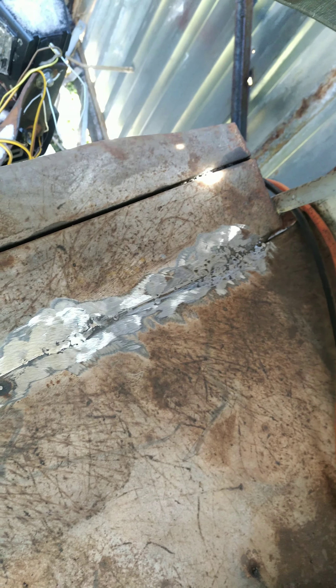As you can see I started spot welding some of this back in place. Because it's sheet metal I'm going to spot it like that, and come back, keep spotting it, keep grinding it down, until I actually get a solid weld one side to the other. Clean it all up so I get good adherence and good penetration from the welder. I'll show you again when I get more done. These gaps are always fun.